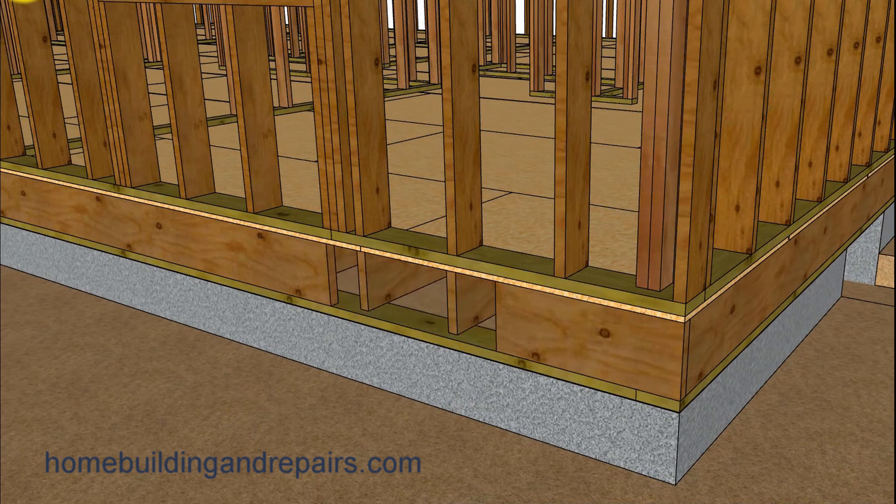If it's just a little bit of damage to the rim joist you can simply cut it out and replace it without any problem. If you need to do long sections, sometimes it's going to be a good idea to do small pieces at a time — maybe four feet at a time — and then just put a strap or some type of connector if you're worried about getting some type of strength for it. To pop the whole thing off and replace it could be questionable depending upon the framing. I would say you'd be safe up to about five feet; these are 16 inches on center so that's about four foot. This is probably about five foot ten inches, almost six foot, and I think even a six foot piece of rim could be replaced in one shot most of the time.